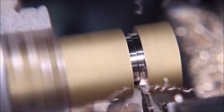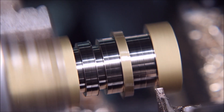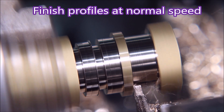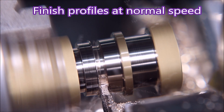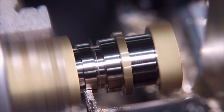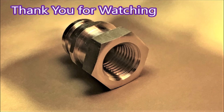So we just hurry through this roughing and then slow it down to look at the profile being cut. There's the first part of the profile going in that direction, then we pull out and start the next bit in the opposite direction. I'm hoping this will create the radius that we should have. There's a bit of rapid there to get up to the point where it starts cutting, but I didn't worry about it. Now you can see we're going in the opposite direction again — round that radius. And I don't normally part things off like that; I tend to tap them off. But you can see the radius is back, so I went with that profile and finished making the parts like that. And that's what they look like when they're finished.